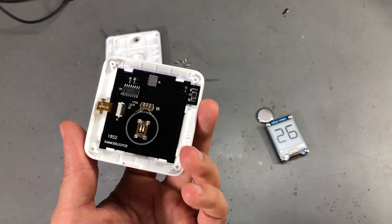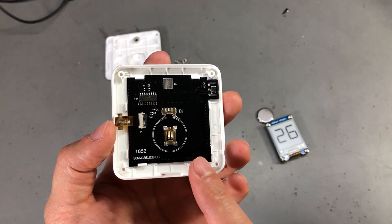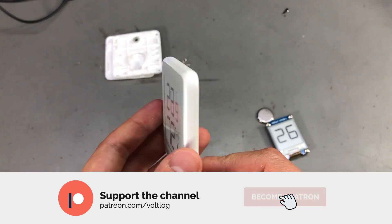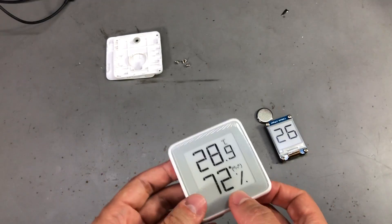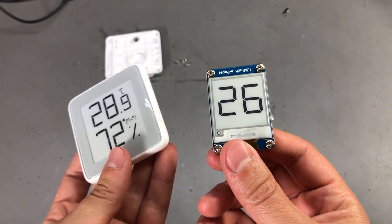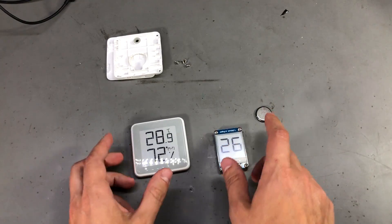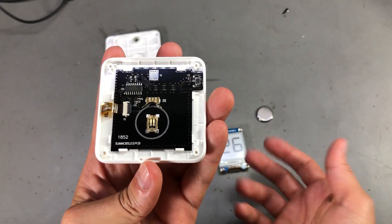That would confirm they are using an ePaper segment display, and from there it should be pretty easy to send our own commands and repurpose this. You could also go all the way and redesign the whole internal PCB to have another microcontroller, maybe with Wi-Fi or Bluetooth. I'm not sure I'm going to follow that idea — it was just something I wanted to share: that putting them next to each other, one could be a segment ePaper display and the other pixel-based, and you can't tell just by looking. My initial thought was just to replace the battery, but since I was already inside the unit, I said why not address this topic as well.